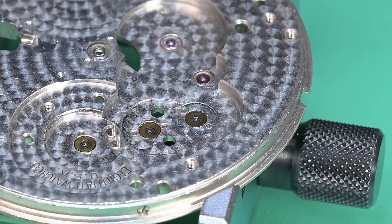That looks easy but it took me a while to figure that one out on my stepfather's watch — before I figured out the easy way to install that part. Now that's in place, and lastly a bit more grease on a few points where it's going to make contact with the yoke. We can just give it a test and make sure that nothing's binding up and it springs back into its first position — that looks great.